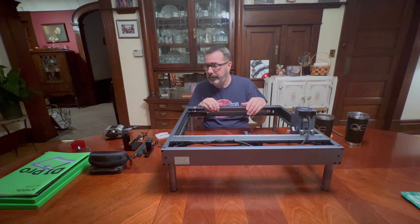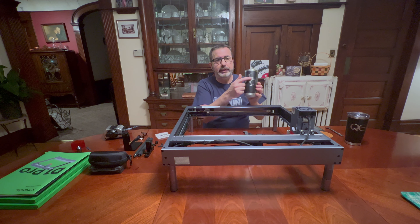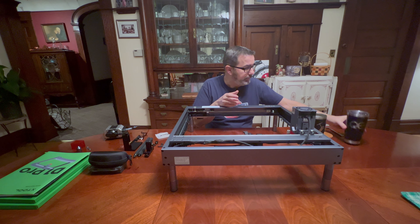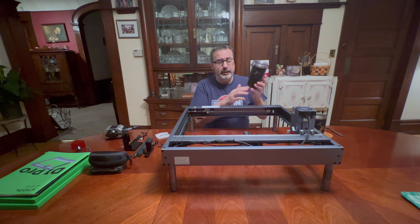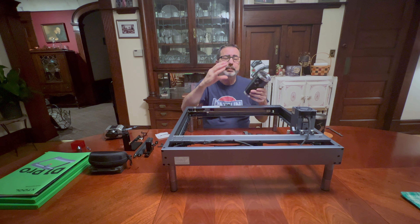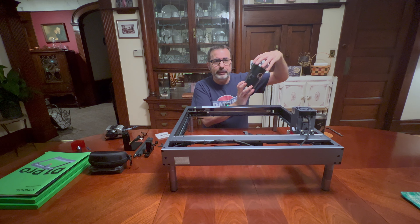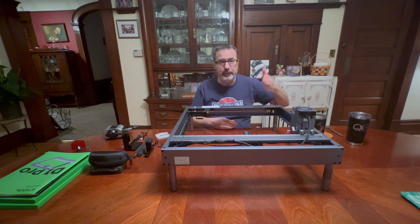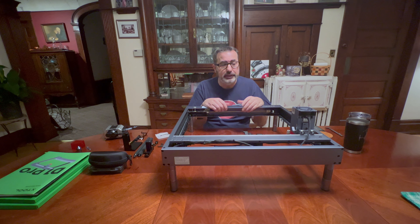That's pretty much everything with this. The tumblers didn't turn out beautifully — I was overheating — but this one here turned out pretty good. If I was actually selling a product, this one is sellable; this other one is garbage. Buy yourself a sacrificial lamb — buy a couple of them. Keep your logos small, like 20 by 20 millimeters, so you can keep burning and have lots of room for mistakes. Keep trying until you dial it in. Write down notes and save your projects and files. Don't give up — it can be frustrating. Going from under 10 watt, which I used for 5 or 6 years, to a 20 watt was a big struggle. I've also got a 10 watt, and that's the happy medium.